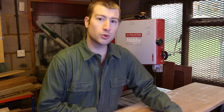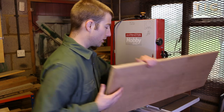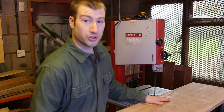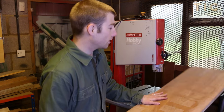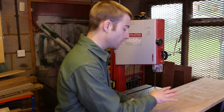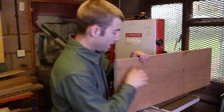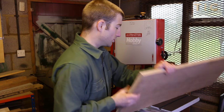I'm going to fix a small strip of wood on the underside of the sled that will run in the mitre slots and control its linear motion. I also want to stop the sled from tipping either backwards or forwards as I run onto or off the table, so I'm going to somehow hook over the edge of the table to stop that.